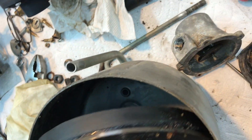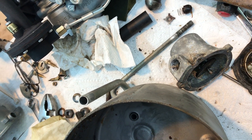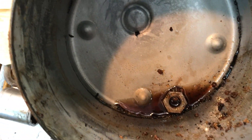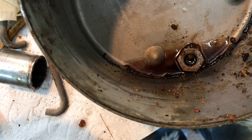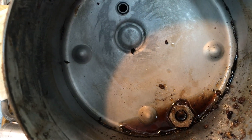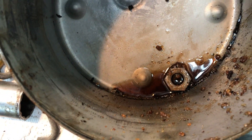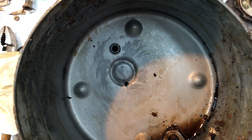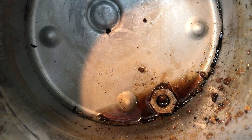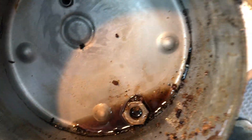But then this is the strange part: when I took it apart, you've got a leather vacuum diaphragm in here. For a leather vacuum diaphragm, you are supposed to have a port on the lower back of this thing so that mineral oil can be put inside there to lubricate the diaphragm. And this is what's so strange.